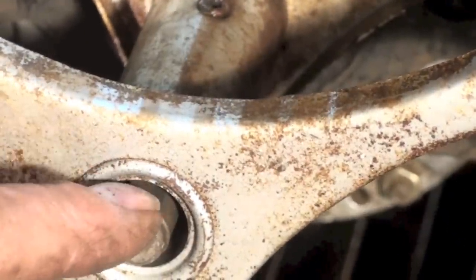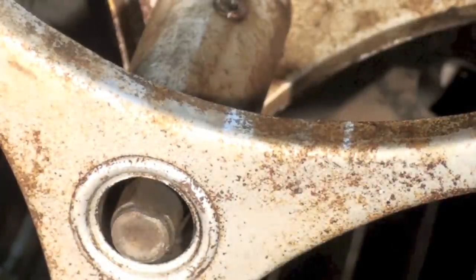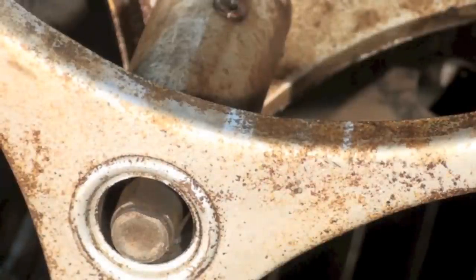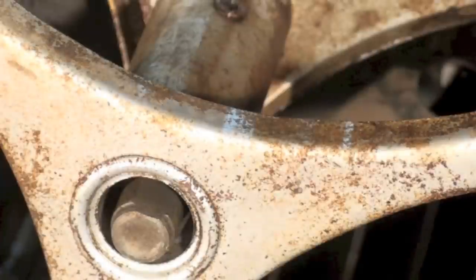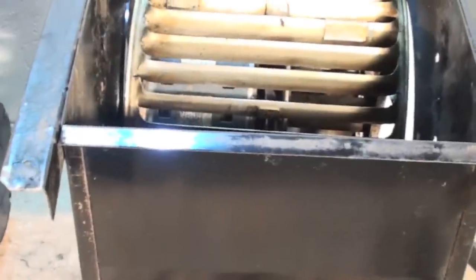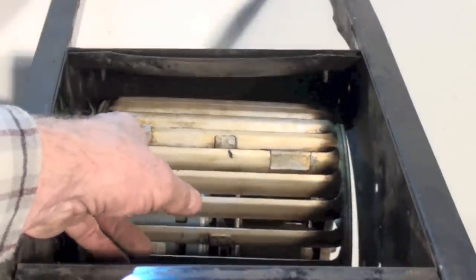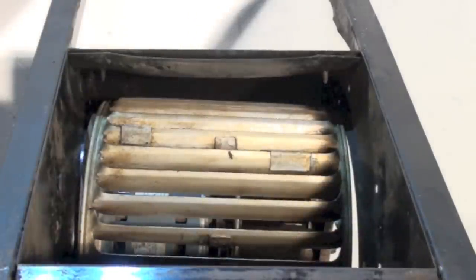See the flat of the shaft is up here and it's in line with the set screws. You want to tighten that up with the flat in line with the set screws, because you do not want the set screws to tighten down on the round of the shaft. If it tightens on the round, it'll probably ruin the shaft and very possibly ruin the blower wheel too, not to mention it'll spin or stop working. Make sure you tighten on the flat. Also make sure the blower is as equidistant as you can get from the edges, and then the blower is ready to install.